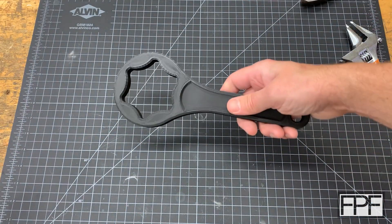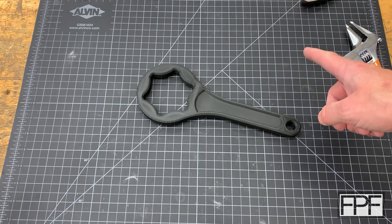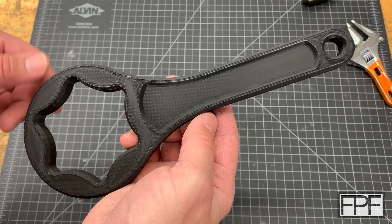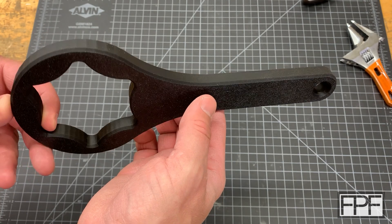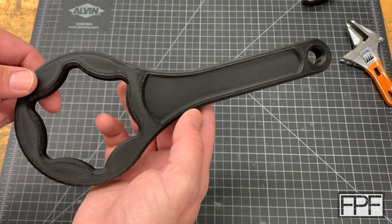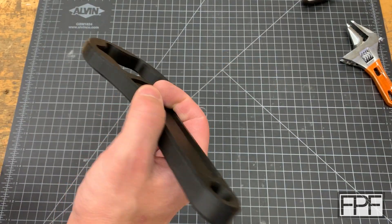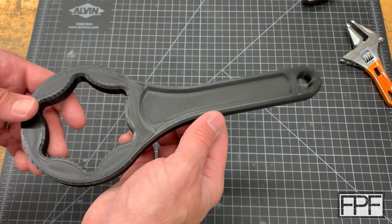Our lowly 3D printed plastic wrench did what every one of those ten wrenches couldn't do. That ended up being a little bit anticlimactic — I kind of expected this to creak or groan or flex or bend a little bit, but no, it was a total champ. I don't think we're anywhere near the yield strength of this wrench. I think between the six walls and our fairly dense gyroid infill, this thing is honestly overkill for that application. But that's good — a wrench that you're using for something should probably be about 10x what it would actually take to cause that wrench to yield.